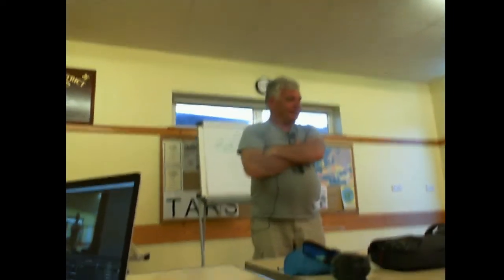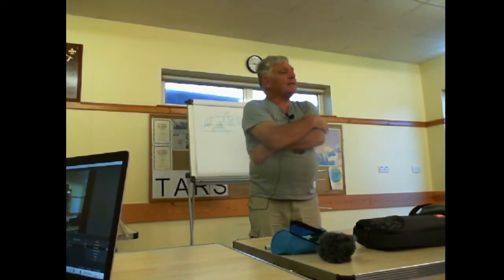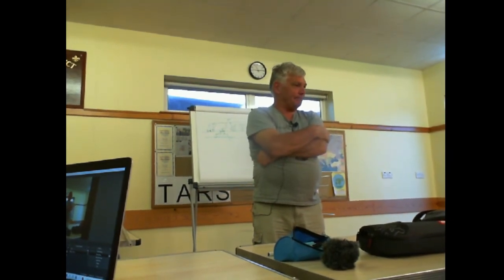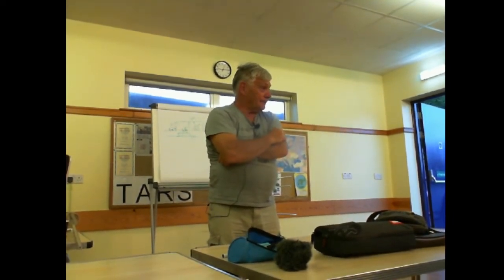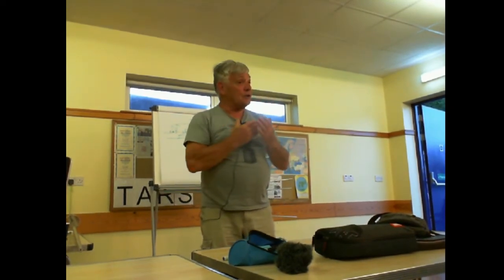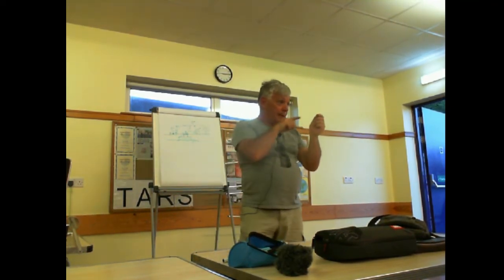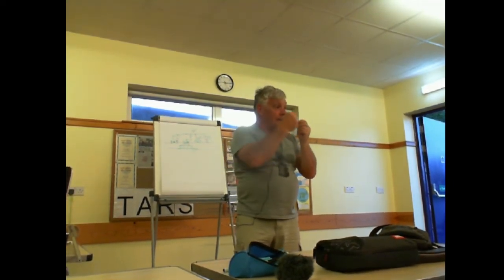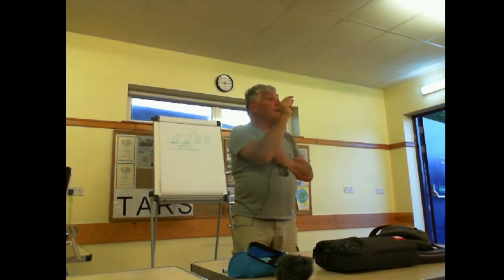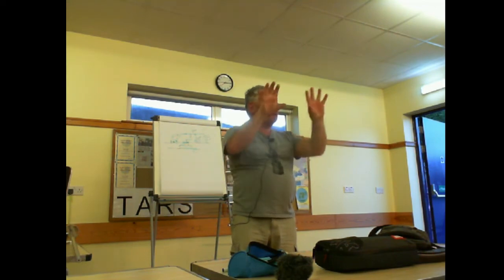And then I had a brainwave. I thought, let's go and have a look at the coax socket in the wall that the builders have put in. If you've ever installed a coax connector point socket on the wall, you know that you get the piece of coax, you trim off about a centimetre at the most, pull back the braiding, and then you make a cut and you have the live side come out of the coax cable, and you just push that in, screw it all up, put it back on the wall.